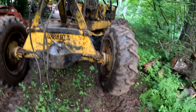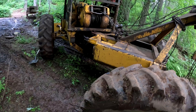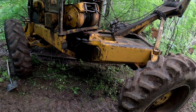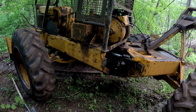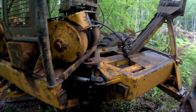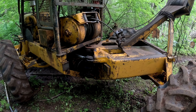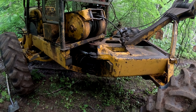This is a Garrett 15 skidder — about 8,500 pounds. We have another one just like this but it's original with a diesel, and it literally burns half the fuel this one does, and this one doesn't burn that much fuel to begin with. Unfortunately, that's how I learned there are two different types of number nine winch — the winch on that diesel skidder has the different style mounting of the lock brake on the outside of the brake drum, which is how I figured out that inconsistency.